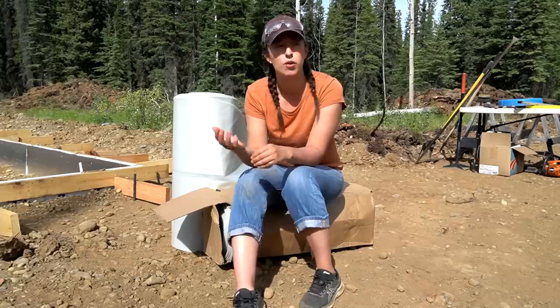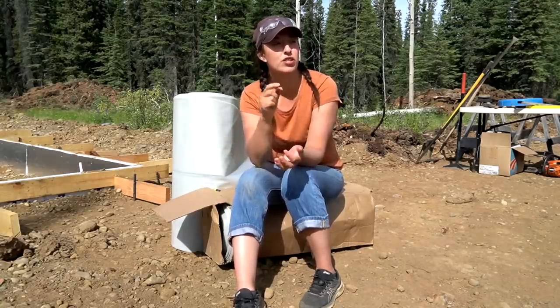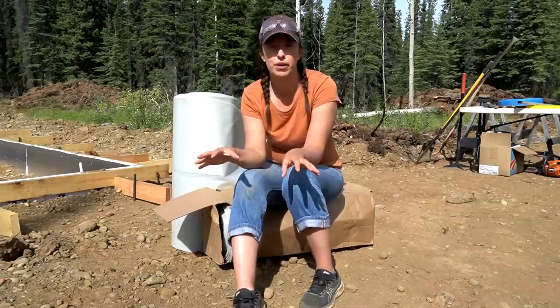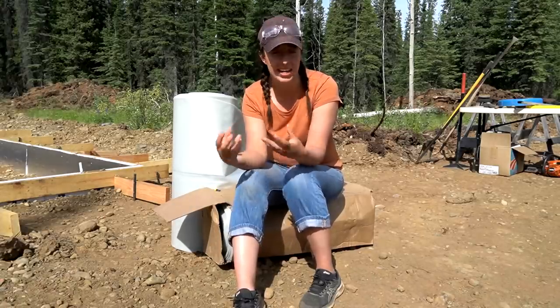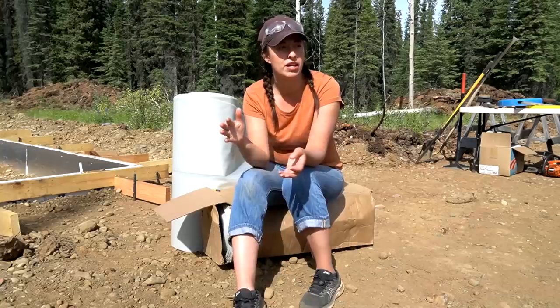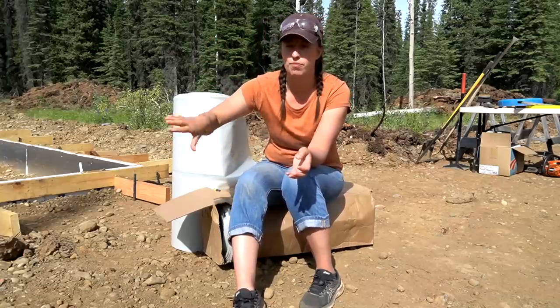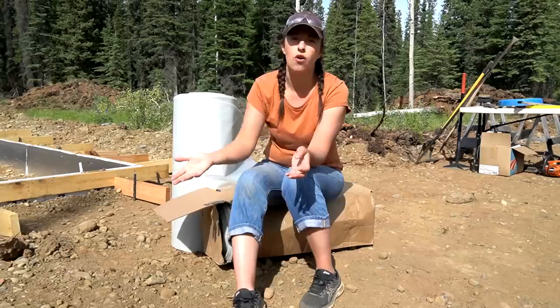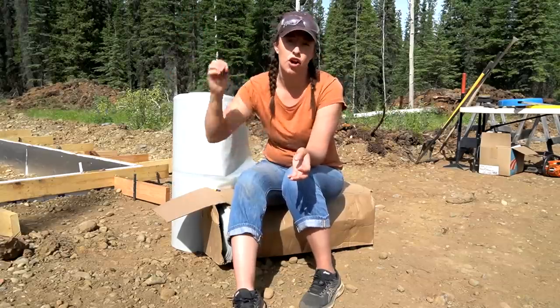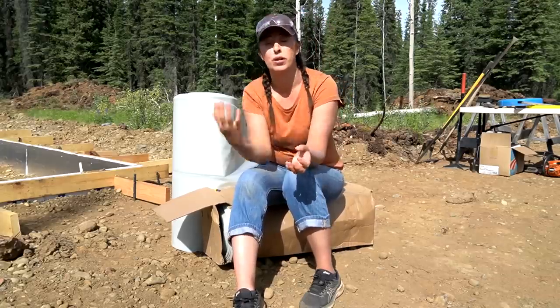It drains really well, but there is moisture in it, of course. And in fact, our crawl space, you can tell of our house, there's no sort of barrier. There is quite a bit of moisture in the crawl space. And so the reason you would do it that way is you are keeping your foam above the moisture. So you've got that vapor barrier or the poly down below, and then you've got all the other elements above it, and the condensation will stop right at that poly because the ground is what's cold here, and then we're going to be heating the shop.